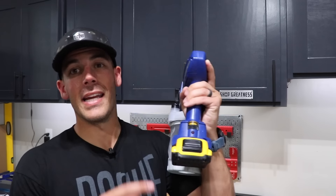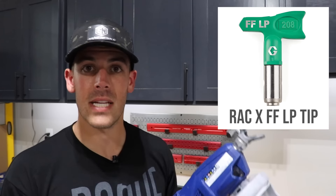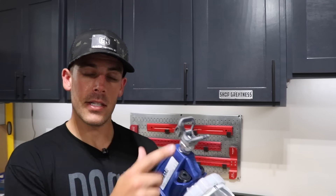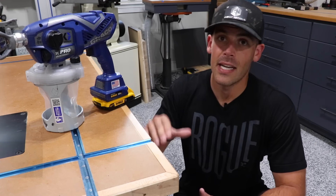The second feature I really like is the adjustability — not just in terms of pressure, but also in terms of tips. Because this uses a more advanced tip, you have more tip options, making it that much more adjustable. The TC Pro uses its own proprietary tips, whereas the other cordless version, the Ultra, uses the standard RAC FFLP tips — which most paint stores like Sherwin-Williams carry as standard in a bunch of different sizes. So you can adjust both pressure and tip to really fine-tune the sprayer and get a really good paint finish.